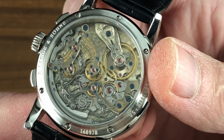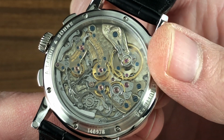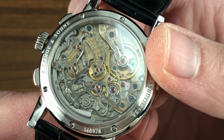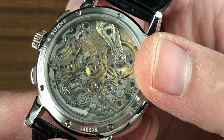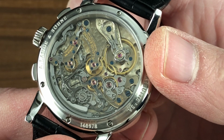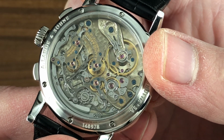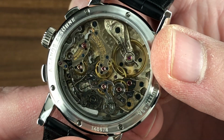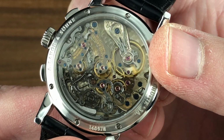The timepiece, beautifully executed, but with a short power reserve, manual wind at 36 hours, it ticks away at 18,000 vibrations per hour on an oversized pocket watch style balance with a handmade Breguet overcoil hairspring to beat concentrically and keep good time in any position on your wrist. The 40 jewel movement is adjusted in 5 positions, which is the high horology standard, and you can see how many components are black polished.